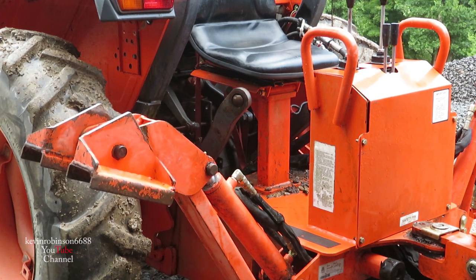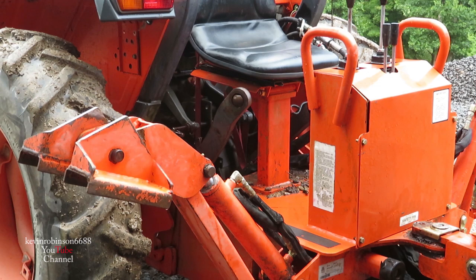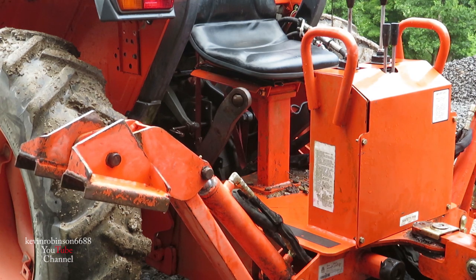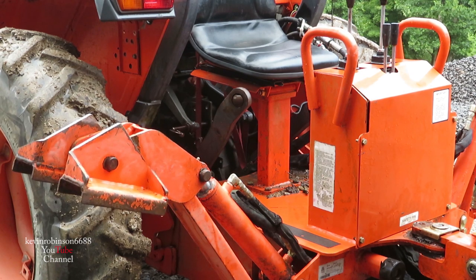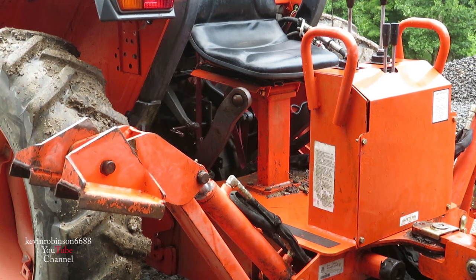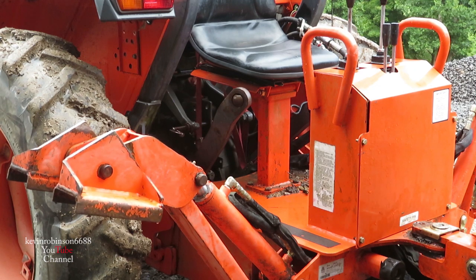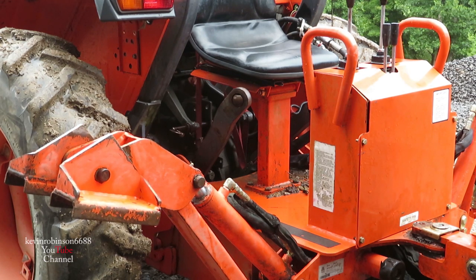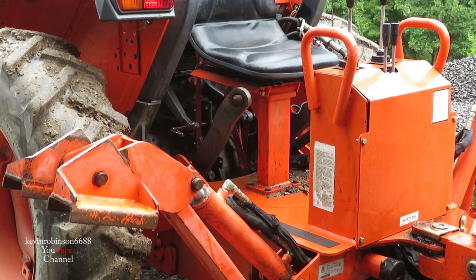Keep an eye on it — yes, it is going down, and that's with pressure against the valve. If we went over there and moved the valve, it would work that outrigger. It's going down but very, very slowly. If you watch the tire on the tractor as a reference point, you can actually see it moving slowly but surely. That kind of tells me it's going to be the cylinder — though I don't know which is more expensive to rebuild or buy.